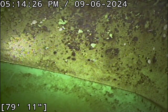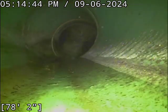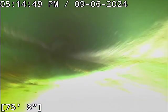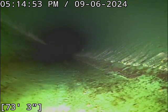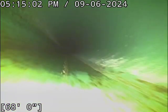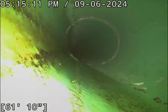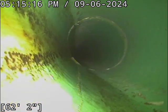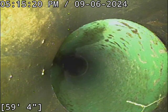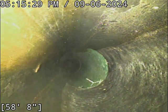As you face the house from the street — that's how I describe everything — if you're looking at the driveway skirt (that's the last piece of driveway as it attaches to the street, it'll usually flare out like a skirt does), at the left side portion of the driveway skirt you'll notice a rectangle saw-cut patch where you can tell a piece of concrete was taken out and replaced. That patch would appear to be where the sewer line was run. This is where my locate comes in — it's perfectly in line with that. Based on where the vent stack is, all that's lining up. The line looks like it shoots out of the house just a couple feet away from where the right side of the house proper attaches to the garage — to the right of the front door, but very near where the house meets the garage.